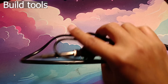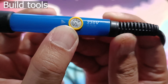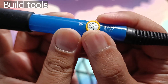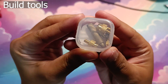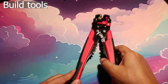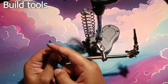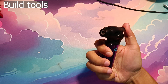Now let's move on to the tools you'll need: a soldering iron set to 350 degrees Celsius — you'll need 350 degrees for most of the time to get the solder tin to stick to the copper wires — a brass ball to clean the solder iron tip, a brass tip to melt the brass inserts into the case, a solder sucker if you mess up, a wire stripper, a wire cutter, helping hands with some shrink tubing, tweezers, a small screwdriver, and a jet lighter.